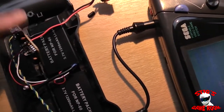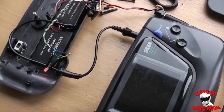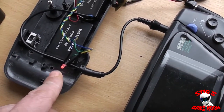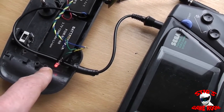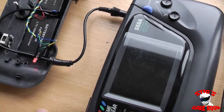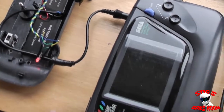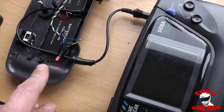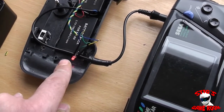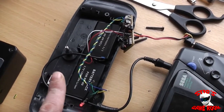It's daylight now — I got about an hour and a half out of the battery. It turns out they weren't actually fully charged; I had the LED wired up the wrong way, so as it was charging it was showing green instead of red. I ran the batteries flat, then charged them for about 15 minutes and ran the Game Gear — it ran fine with no power warning. It's definitely charging. I'm leaving it to fully charge to confirm the LED turns green, then I can hot glue everything into place and put it back together.